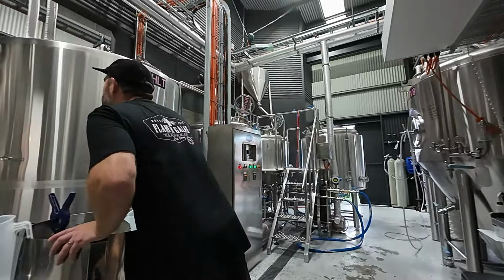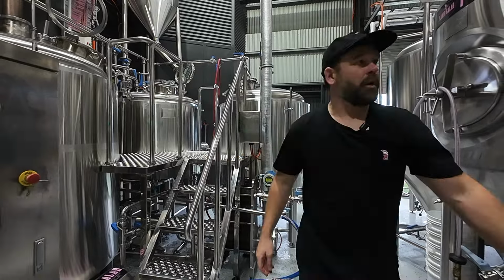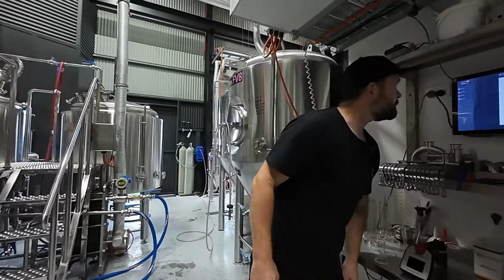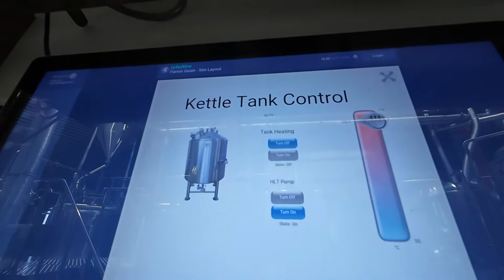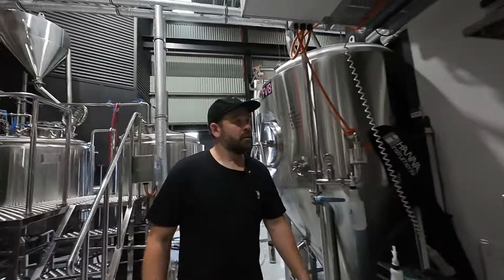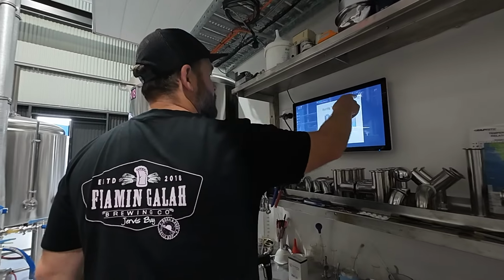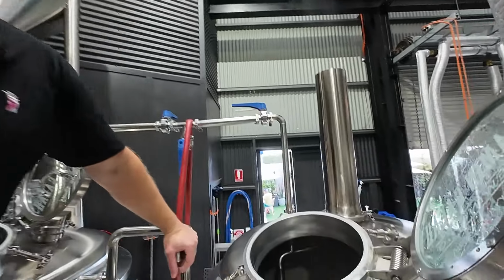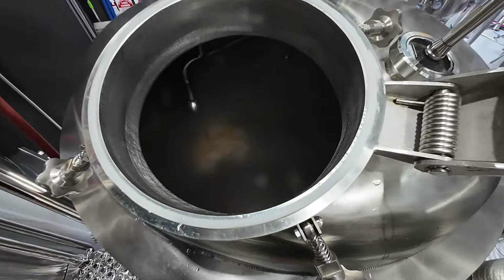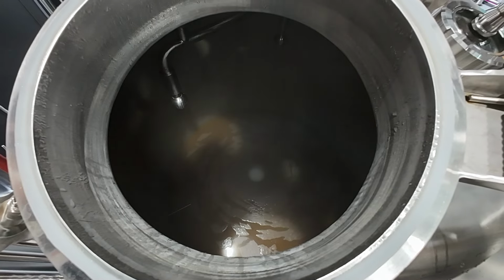32. Cold liquor's going in. Feels like I'm running hot there, I don't want to overshoot. Looking a bit cold there, Sean. Might just send it at that now, with just the cold water going through the one side of the heat exchange. See, we're taking from the centre dump valve of the whirlpool because we want all the wort back in the kettle at 40 degrees C.